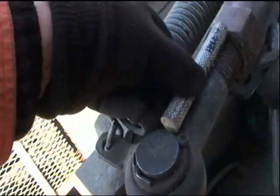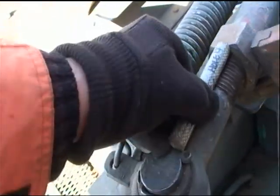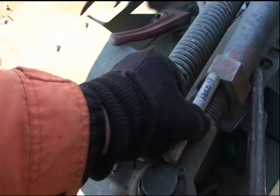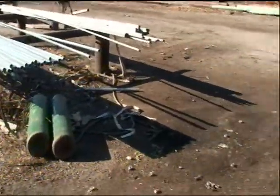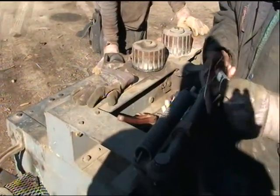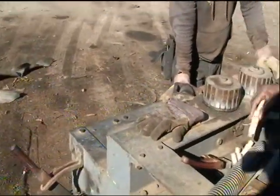We're going to open that up a little bit until this thing fits right in here. That just fits right in there, and we're going to save this — this is the one that we know. Now we should be able to just take a piece of three-quarter inch, put it in, and we know it will come out 14 foot wide. We don't have to play around every time and bend a sample. So let's try that and see if that works.